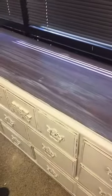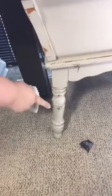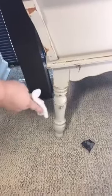The question was how do you get the glaze on chair legs. The answer is when your rag is all covered with glaze - whatever color you're using - take it and, here's a chair leg, wrap it around the leg and twist like that. You can't see it very well because we're using linen, but if that was dark glaze it would work perfectly.